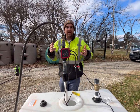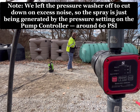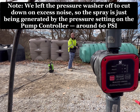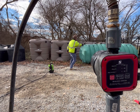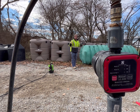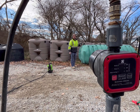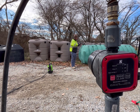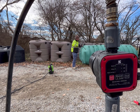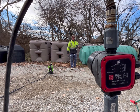Let's see this pump in action. Right now, this system is pressurized and we have it feeding a pressure washer. As this line begins to bleed down in pressure, the pump controller senses that and turns the pump on automatically to build up pressure. As soon as it builds pressure, it stops operation. When I release the nozzle and stop the flow, it senses that, runs a little extra so it doesn't short cycle, and then shuts the pump off until flow is called for again. Flows off, pump controller runs a little extra, shuts down. Great automatic pumping system.